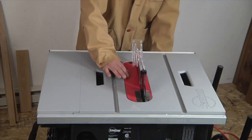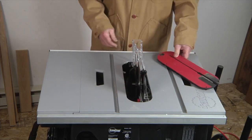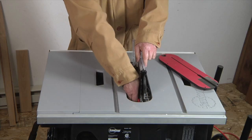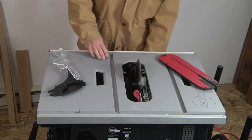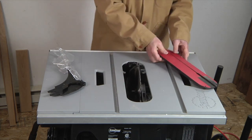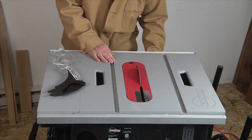Let me take you step by step through the cove cutting process using nothing more than a standard general purpose saw blade and a couple of straight strips of wood used as fences clamped to the top of the saw table. In preparation for cove cutting, we'll go ahead and unplug the table saw and remove the stock blade guard assembly — this is necessary because stock is going to pass directly over the top of the blade, and we're going to use push sticks to make sure we're safe during cutting. Then we'll replace the zero clearance throat plate insert.